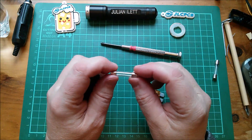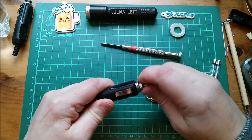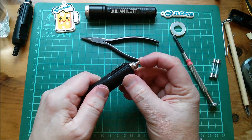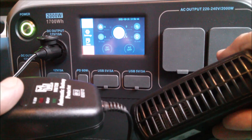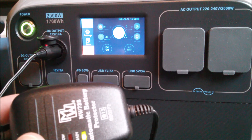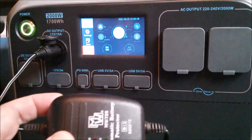Well I just tried it off camera and silly me I put one of the 5 amp fuses in - that blue one. Now the problem with this fuse is it's slightly bigger but let's see if that fits in there, and I will put the camera on my test setup. That's rock hard now - it has no movement at all. I've jabbed it down on the desk and now I've got about half a millimeter of movement - that'll have to do. Let's see if it works. There's my little mat pin thing, there's my fan heater. Switch on the DC - that's come on, and the fan's on. I can hear it running. 136 watts on the unit... 143, 144, 146. 147 seems to be the trigger on this unit and it's cut off.